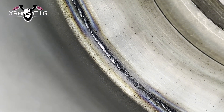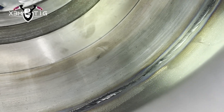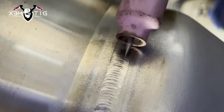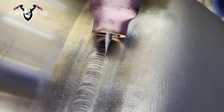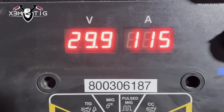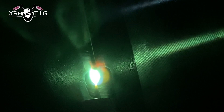That's the root — there are a couple of spots at the tie-ins, but overall the root is solid and good, nice and thick. That's how it should be — lots of meat, no worries about suck-back. I was doing one pass hot and filled to flush, and there was no sign of suck-back, which is good — thanks also to the purge flow. This is 115 amps for the cap. Everything stays the same: 3/32 filler, 1/8 tungsten, cup size 8.